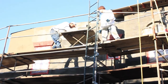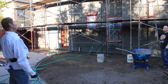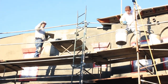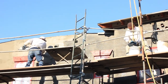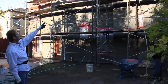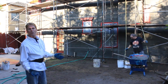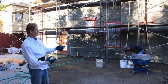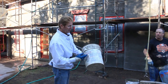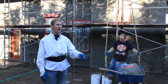What we're doing is old John down here is pulling up these buckets and Carl up top is taking them off. My buddy Mr. Dominguez — I love that guy, he welds, he's a plasterer, does everything — I couldn't find my own outrigger type of hoist, so Adolfo welded that for me last night. It's important to have a good arm; you can go online and find those arms that hold pulleys. Most of them — you get what you pay for — because some of them just aren't constructed well enough to hold the amount of weight. When you're pulling these buckets up, I have a metal piece that clips around here so you don't actually use the handle. This bucket had the handle come off, so as we're pulling them up I always tell guys, back off — if that handle pops we don't want it to hit you.